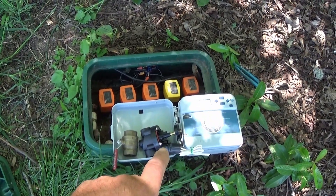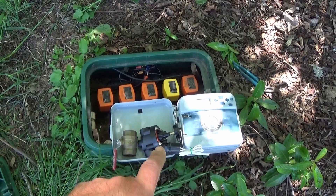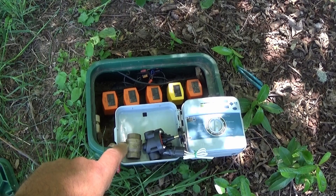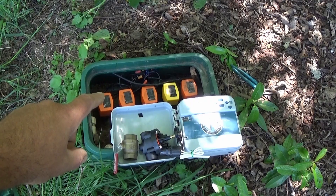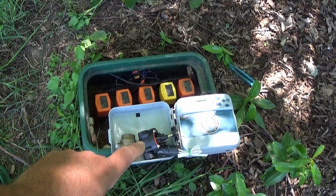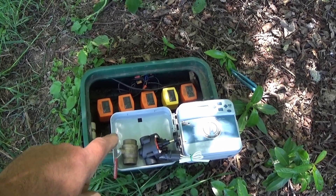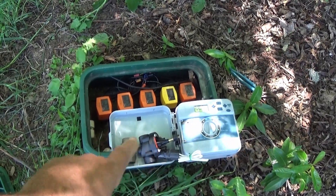The three reasons the solenoid valves won't work reliably are low water pressure, high water pressure, and extremely dirty water. The ball valve doesn't really care, and the motor doesn't really care. These will work on low pressure, high pressure, or extremely dirty water like sludge. Another unique thing about these is they open and close very slowly, very softly. So if you have 100 PSI and it's really slamming your main line open and close with your solenoid valve, these guys will open and close very slowly, making the start and stop much more easy on the water system. It doesn't hammer nearly as bad with these guys.